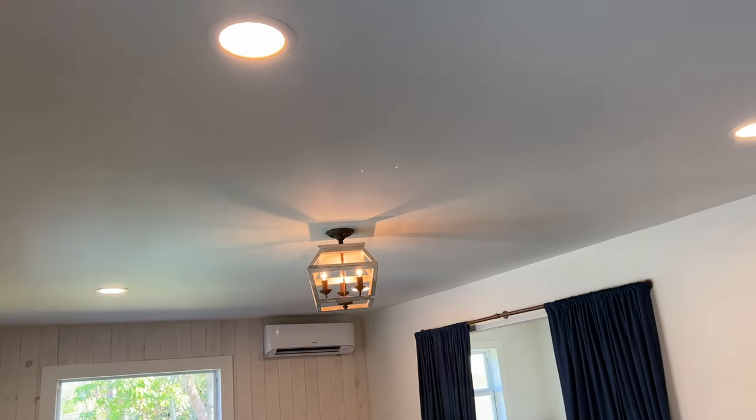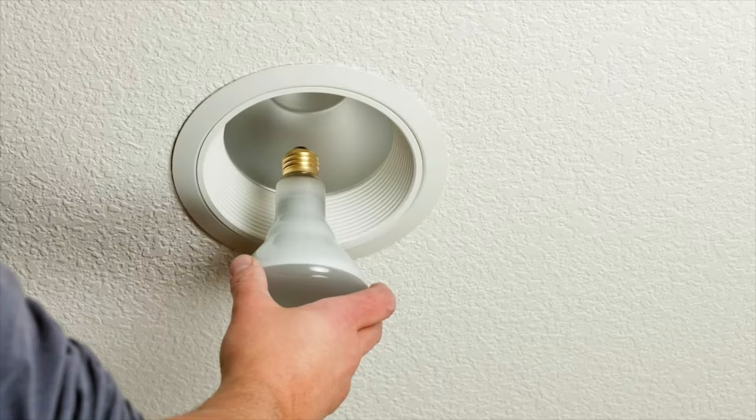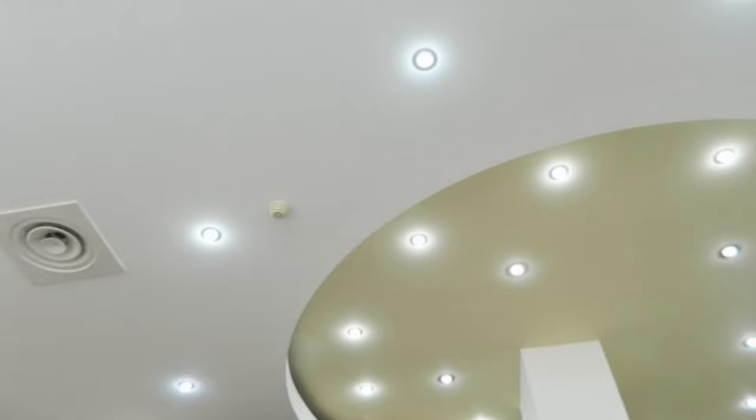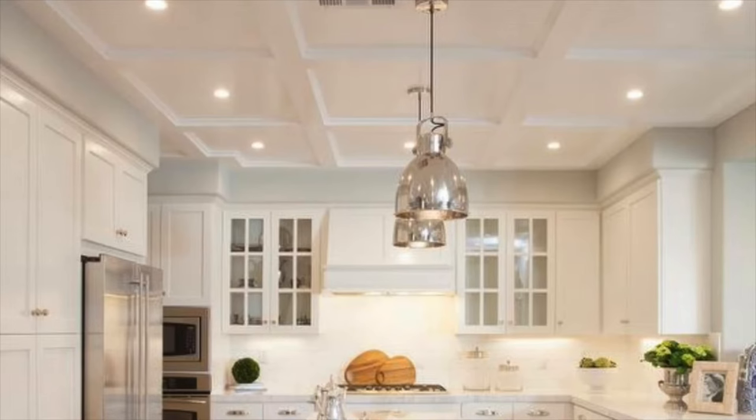There's no way to minimize that with these lights. They are dimmable — fully dimmable — but they're not as dimmable as a regular recessed can. With a recessed can, the bulb sits up away from the surface of the ceiling. That way, when you turn the lights on, there's not that huge hideous glow coming from your ceiling. It's hidden up in there and it's just a beam of light concentrating focus on the object, not on the ceiling.